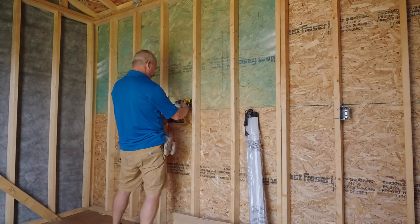Okay. Now, let's talk about the elephant in the room, because a lot of you guys are going to want to use a shed for tools. Here we go, curve our wires. And you're like, Jeff, you should be using yellow wire. Use the 20 amp. Use a higher gauge. Use that 12 gauge wire. And then you would use this plug. You see the difference? The ones with the T are identified as a 20 amp plug, and these are a 15. The T stands for 20. That's how I remember anyway.